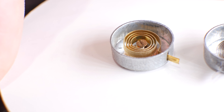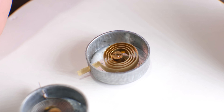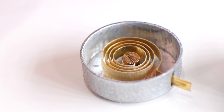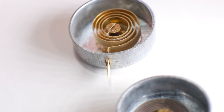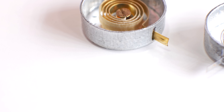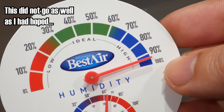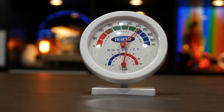Take a closer look at it and you'll see that one side of the coil appears to be covered in a sort of paper — and that's because it is. This style of hygrometer, fittingly named the Metal Paper Coil Hygrometer, functions identically to that of a bimetallic thermometer. The key difference is that the salt-impregnated paper changes based on humidity. You know what happens to paper on really humid days — it gets all floppy and gross. Same sort of thing goes on here. The paper side of the coil will deform slightly as humidity increases, changing the overall tension on the coil. That makes the needle move. Watch what happens when I put a bit of water directly on the paper — the coil quickly deforms and the needle shoots to very damp. And here you'll notice that the scale is very much not linear. Low humidities are far apart, indicating that the effect of the humidity on the paper diminishes as humidity increases.